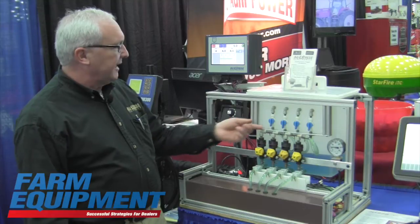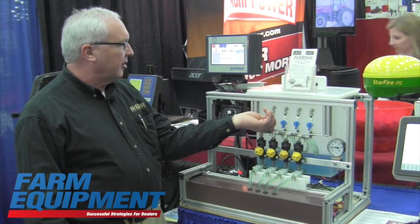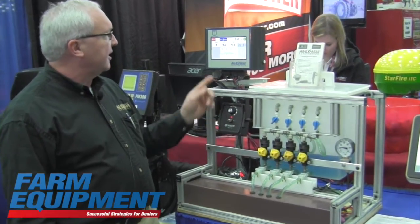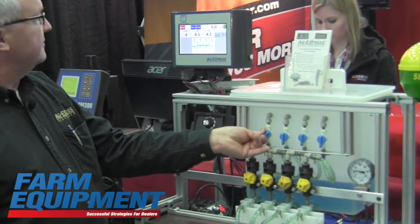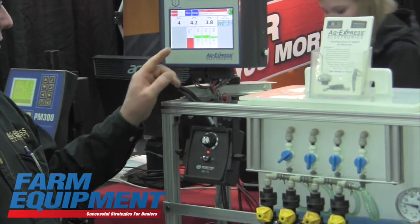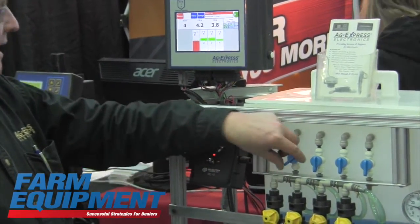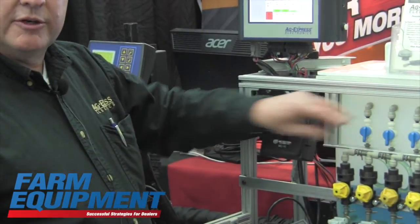On this page, I'm going to show you a low limit alarm. I'm just putting a slight blockage in the line on row number one, and you'll see how it's creeping down the page. Once it hits the level, it's alarming, and the bar graph will read an alarm point that you have a problem on row number one.